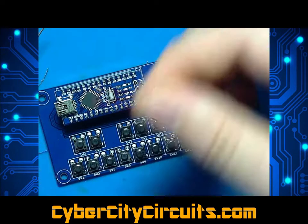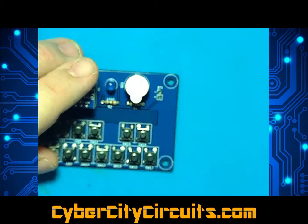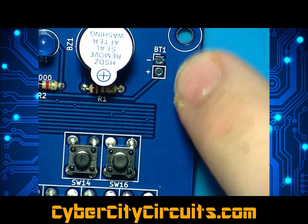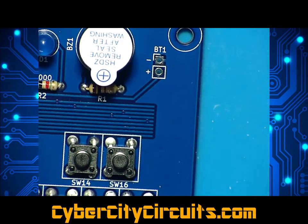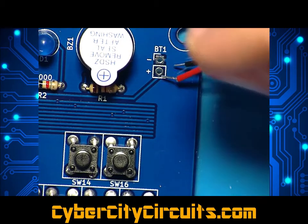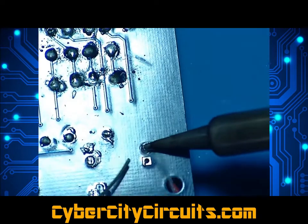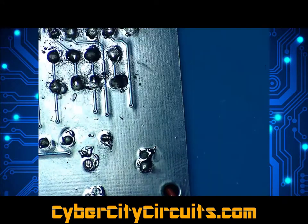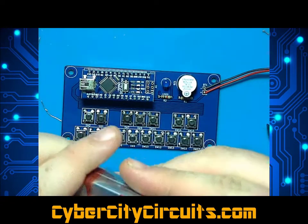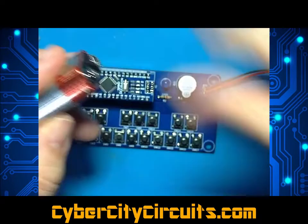Let's go ahead and connect our battery connector. So, if you look at it, there's a hole marked positive and there's a hole marked negative. So the black wire is going to go through the negative hole, right? And then the red wire is going to go through the positive hole. I'm going to tap it with some solder. Just like that.